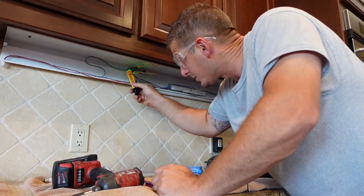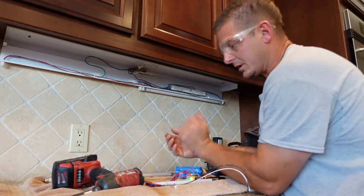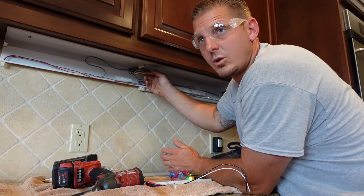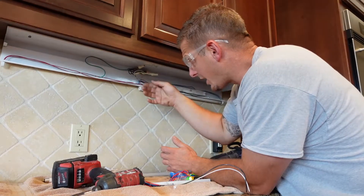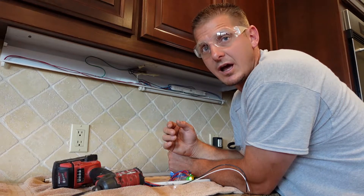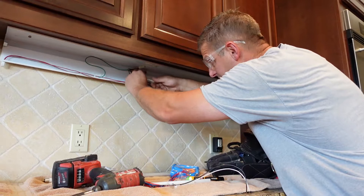The first thing we're going to do is verify that the power source is off. I'm taking my tester and getting no load — we're good there. You do have to be careful in a larger facility setting if you have what's known as a multi-wire branch circuit, where more than one hot is sharing a neutral. Here I know it's not that because it's a wire-in, wire-out with two neutrals. If it were wired differently, you'd need to be careful not to open the neutral under load.